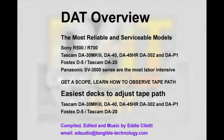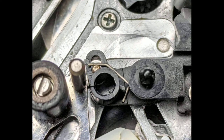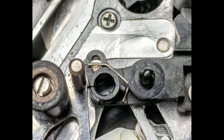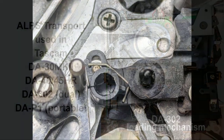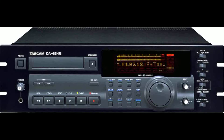Archivists are already aware of the most common DAT issues. I've chosen a handful of models that are inherently reliable, and their known issues repairable. The common failures with Sony, Panasonic, and TASCAM's Alps transports are assemblies that are press-fit and held together by friction. Sony's metal-on-metal tape guides come loose and make out-of-spec tapes. And while Panasonic's cast deck plate is beautifully machined, the base of the exit guide is machined brass, press-fit into a spring-loaded plastic pivot arm — the plastic cracks, and the brass catches on the deck plate and flings the tape into the playback amplifier where it can get tangled on the components. Surprisingly, the Alps transport used by TASCAM has a deck plate made from a molded plastic resin — far cheaper to manufacture than Panasonic's deck plate — but the design is more reliable, and it has to be because the DA45HR is the only 24-bit model.